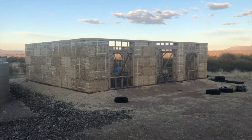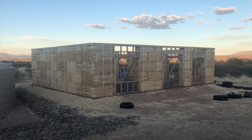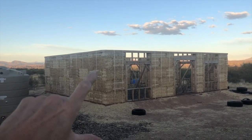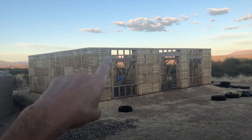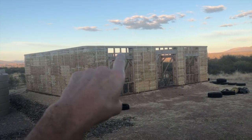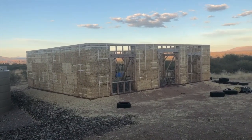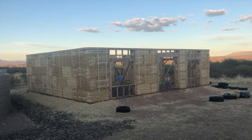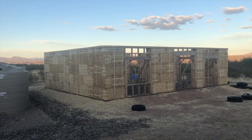All right, guys. It may not look a whole lot different to you, but the box beam up here is actually attached now. Not only by the straps, I've strapped it down and squeezed it, but it touches all the bucks, and I have attached the box beam to the bucks. And so the king studs on each of the window and door bucks and the cripple studs on each of the window and door bucks. So that whole face is flush and plumb, and everything's square. And the top is darn level, as good as it can be.